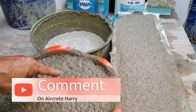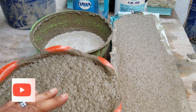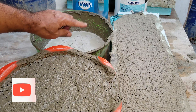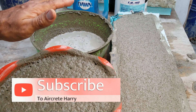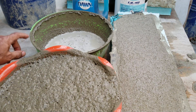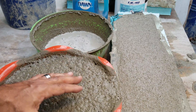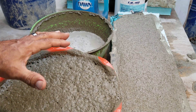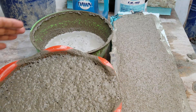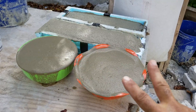The one that I poured has only collapsed a little bit. I don't know what's going on under this layer — we'll find out once it cures more. But my guess is what happened was maybe the mix wasn't fully well blended from top to bottom. Maybe that top layer of aircrete wasn't as mixed as the bottom, or rather there was more cement towards the bottom of the bucket, so the foam had more cement at the bottom. That's the only thing I can figure. That's it for now, peace out.